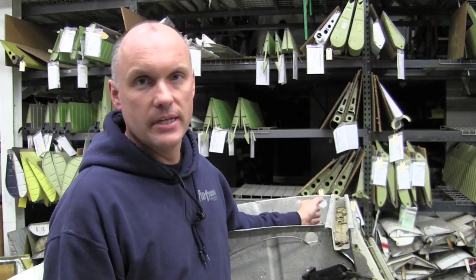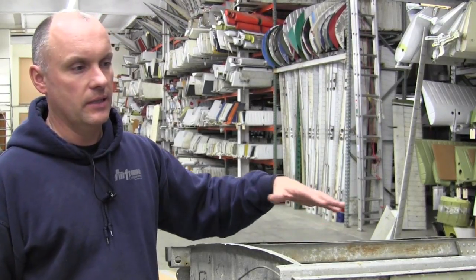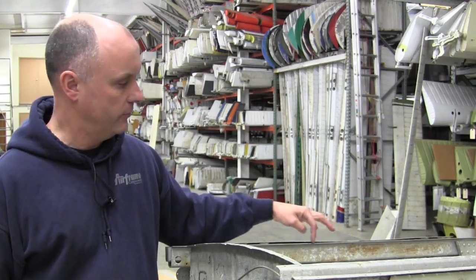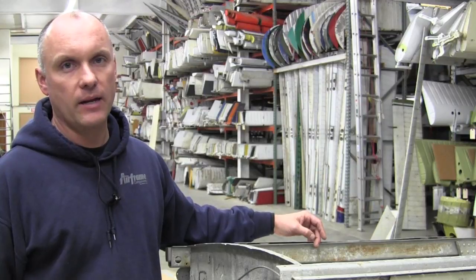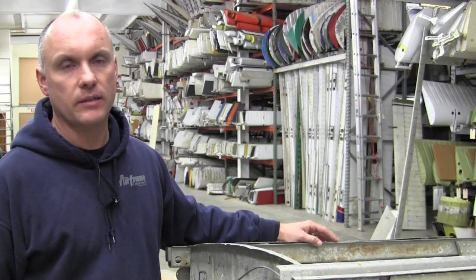As you can see in here, this particular channel is clean as far as corrosion, but you can see there are mud daubers' nests, wasps' nests, bugs — and this is exactly what we're looking for, the problems we're trying to discover during this inspection. With the roof panel removed we can also see external corrosion issues on this rear spar carry-through channel. Corrosion is probably caused by insulation, soundproofing, and interior panels being installed right next to the metal, holding moisture over the years, which facilitates the formation of corrosion.